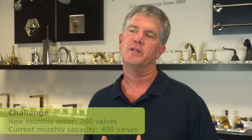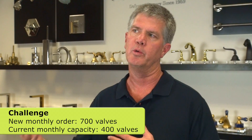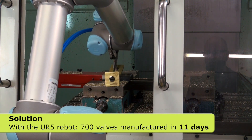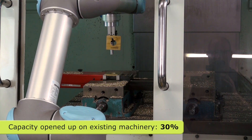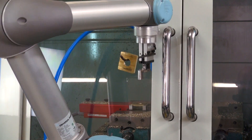One of the first jobs we looked at was a job where we were producing about 400 items of a particular valve, and we knew a new order was coming in for another 700 of those valves — a monthly order. We looked at our capacity on the particular machine that was machining it. Without the robot we would have been forced to buy another machine even if we put a third shift on. After calculating the higher run rate using the robot, we realized we wouldn't have to buy another machine, and we even opened up another 30% capacity on the existing machine.